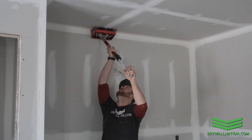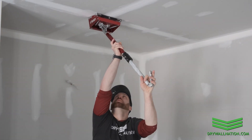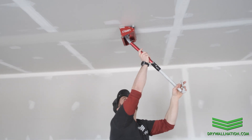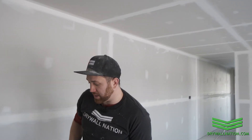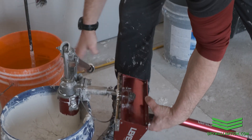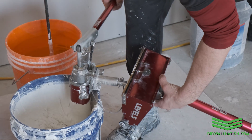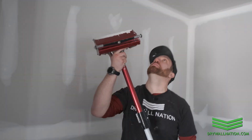I'm going to start right against the wall, let go of my brake, and as I start to push away you can see we're starting to dispense mud along the ceiling. The mud is a little thick — I was running that box wide open on zero, so the tension adjuster wasn't set to any number. You can see the mud is quite thick, so we're going to fine tune that. We're going to put that to one and start back up at the beginning.